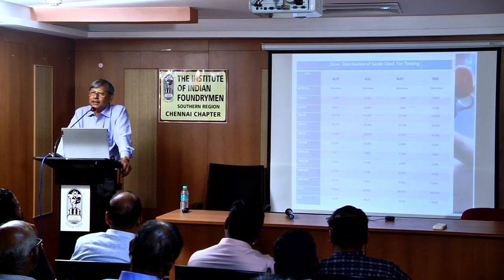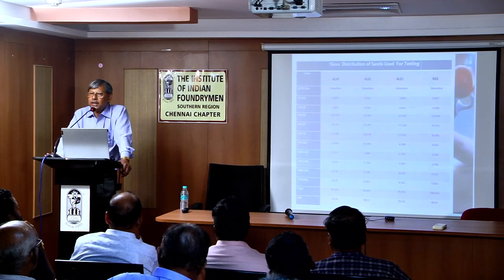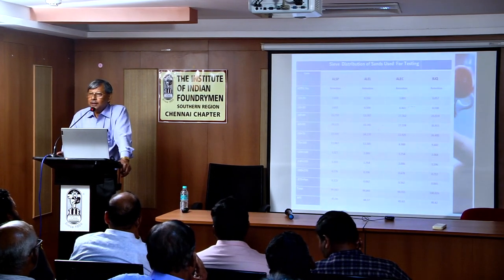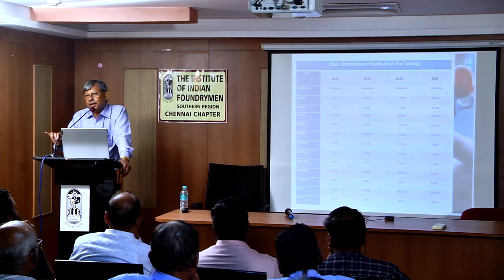But at the end of the day, theoretically, by looking at the distribution and all other properties, there is no expert who can tell that this sand will give 100 psi. It's not possible. You have to see by testing only.